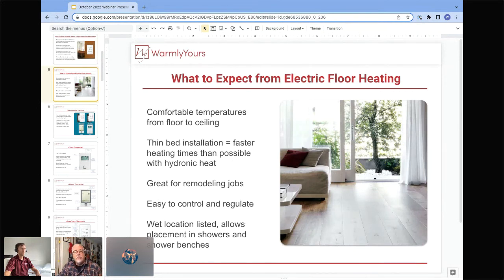If you've never been in a room with a nice toasty warm floor from electric floor heating, the first thing you'll notice is that comfortable temperature coming from the floor — the whole floor heats up and acts as your main heat source. It starts to transfer heat into the objects in the room and into the people in the room. The good thing about radiant heat transfer is it does not really heat up the air, so you don't have a hot pocket of air sitting by the ceiling being lost through cracks. You're efficiently transferring heat from the floor into the couch, the table, and the room gently warms up.